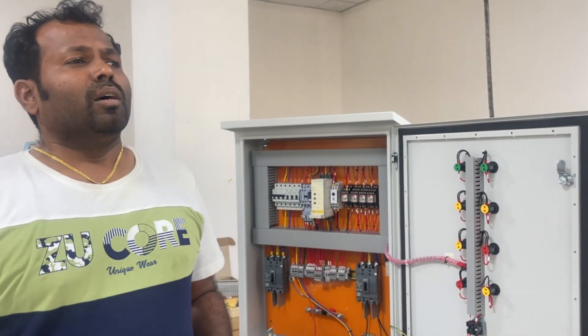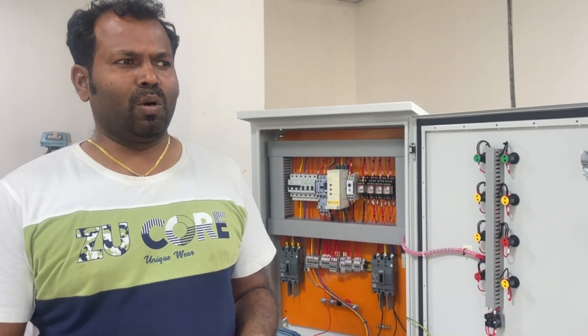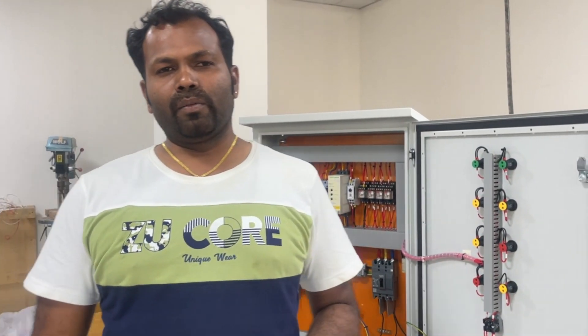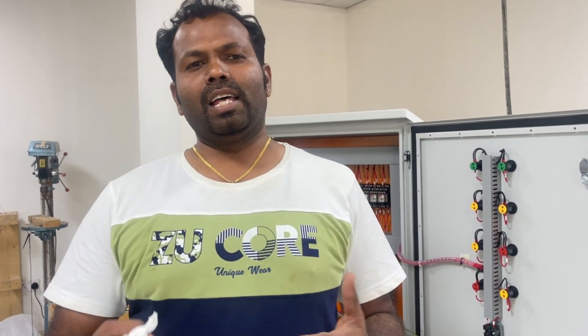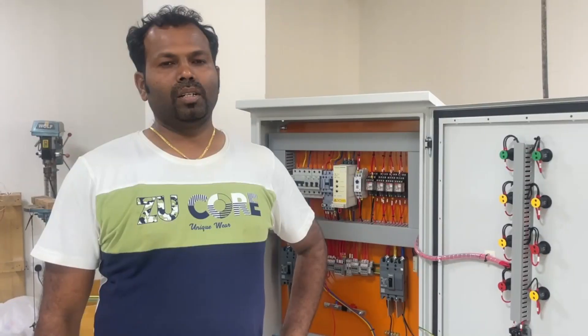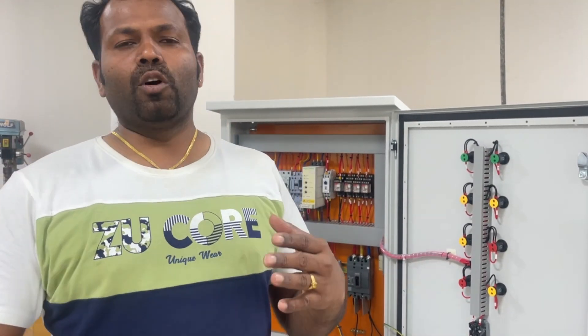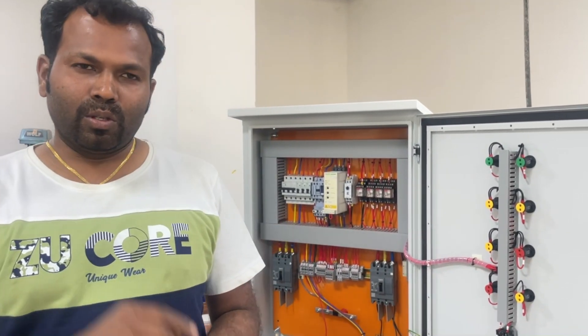This is an FAU (air handling and ventilation) solution. Many people have no idea what a soft starter is. For 5.5 kilowatt or 7.5 kilowatt motors, some people directly go with the DOL starter. What happens with a DOL starter is a high starting current, and when they are starting frequently per day, they have a huge power loss as well as mechanical damage. For 5.5 kilowatt and above, the main disadvantages of DOL and star-delta starters are power loss, mechanical damage, and if duct-connected motors are used, there is a huge noise in the ducts.